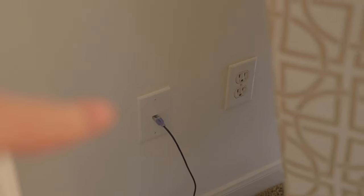Now I have the cables kind of cleaned up, just a couple of velcro ties holding things in place. Now that I have the outdoor access point, there's a cable that goes out there. This wall plate was already here — well, a blank wall plate was — and when I opened it up I found what looked like a chunk of dirt. I pulled it out and it was a wasp's nest. The wasps were all dead, clearly from years ago, but there was already a hole going outside just big enough for a cable. So I put a wall plate on there for ethernet, put an outdoor wall biscuit outside, and ran an outdoor cable to the mesh pro access point.